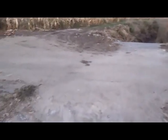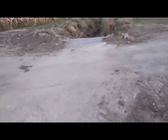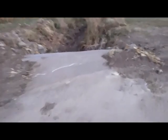But I say for now because eventually we're going to come in and actually cap the whole thing, probably not till next year sometime. We're going to pour another probably 8 inches of concrete right on top of this and extend it out beyond the edges of the current bridge, just to help raise it some so we don't get so much water that runs right down onto it. We can redirect the water easier that way, and it'll make the whole thing stronger and tied together more, because we'll be able to take reinforcement in the concrete and go from ground to ground, and then this will just be more stability underneath that cap. Then we won't have to worry about bringing the combine across or anything.